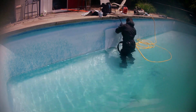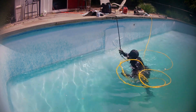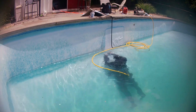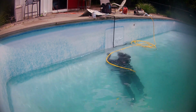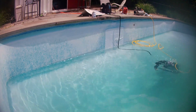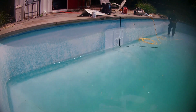As I said in my disclaimer, this is not the only way to repair these kinds of tears, but so far it has worked great for my clients, and if my clients are happy, so am I. Although the repair was successful and my client and his family enjoyed the pool, I need to say that this patch could look much better if my final patch had fewer creases. For that reason, I recommend you store your liner patches as smooth as possible. Every job is a lesson. Learn from my mistakes so you do it better.